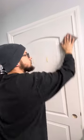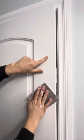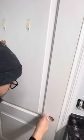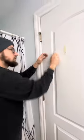Give it some even pressure. You can see as I do it — I don't know if it shows up in the video — but it kind of leaves like a milky look almost. And then for inside these creases, the sponge will contour to these little nooks and crannies on this door. So I'm going to go up and down in those, working one section at a time, getting in those creases, knocking down any heavy stuff, any old fuzz that's trapped in the door either just from dust settling in the house or things that are in the paint.